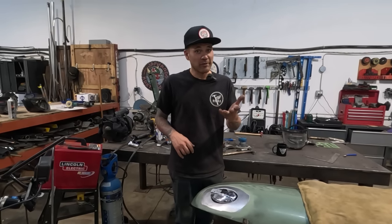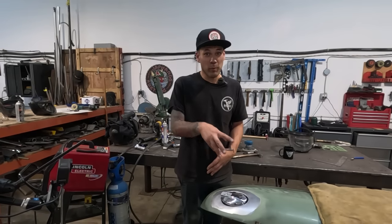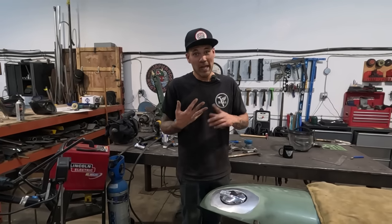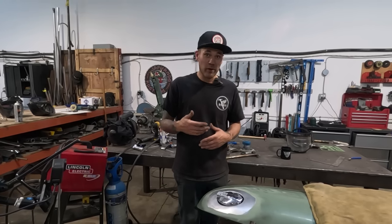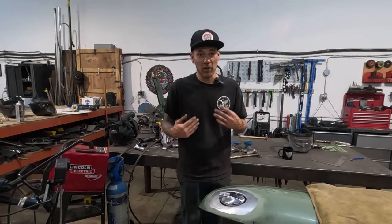But certainly make yourself a flanging tool. Know that if you're gonna do as harsh of a flange as what we did here today, there will be a little bit of extra work with hammer and dolly. Heat as well, with a torch, always helps to soften the metal as you're doing a lot of stretch or a lot of shrink.